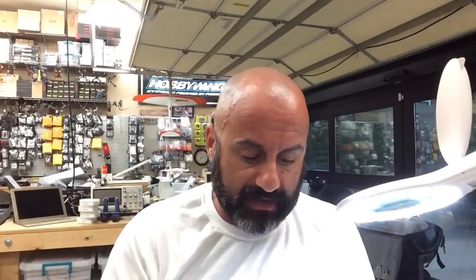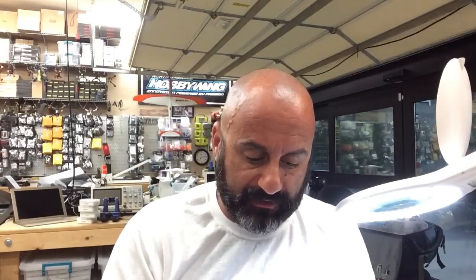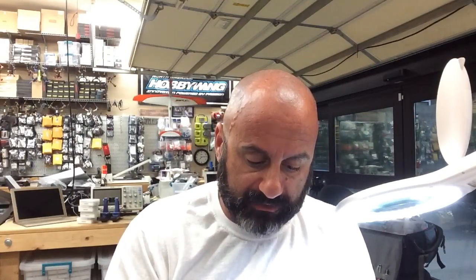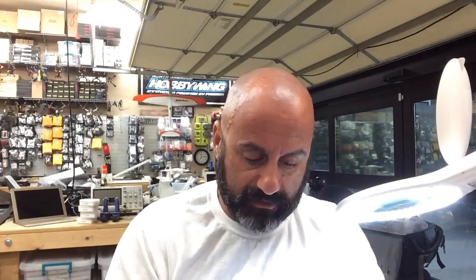Now, you could do it through anything. You can set it up on your goggles to blink and do whatever. But I like using the logical functions here and the logical switches. I mean, it's amazing when you can have a virtual switch for anything that you're doing. So, for example, if you're trying to keep your throttle under 60%, you tell it, hey, I want to use a logical switch that says if my throttle value is greater than 50 and I'm armed, okay,